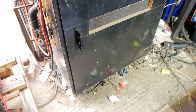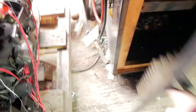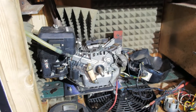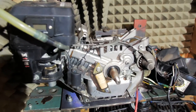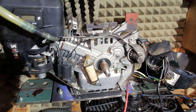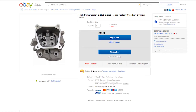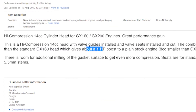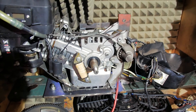So this is the generator station that I built — not much has changed since I did the video a couple of years ago. That's where the alternator and engine setup was. What happened was — I'll put in some pictures from me doing it — I took off the head and bought a higher compression ratio head. The plan was to also advance the ignition timing a little bit by using a stepped key for the keyway, which is quite a popular modification.